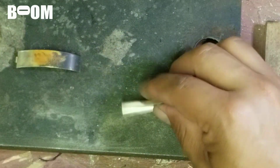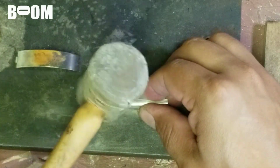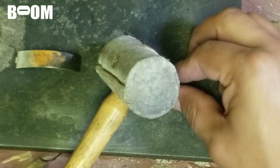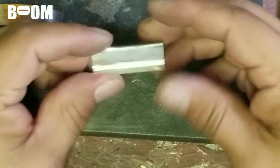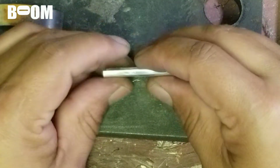And then you have a flatter. And you might have to keep doing that, friends, as you're bending this. It's gonna want to bow again. But you just keep an eye on it and just keep looking at it. Focus right next to the seam, get that to be kind of as sharp as possible. So this is the point we're at now. It is a little work hardened, friends, so I might want to anneal that.